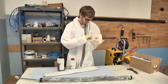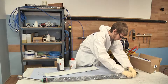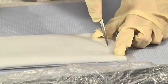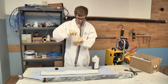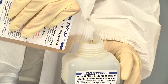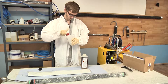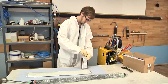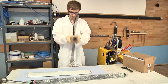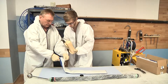The protective bag is placed over the Bend Packer. The protective foil is slit on the laminate so that a vacuum can be drawn. Now the resin components A and B are poured together and mixed by shaking vigorously. It is important to ensure that the resin is mixed without any streaks. Only then is it poured into the prepared liner.